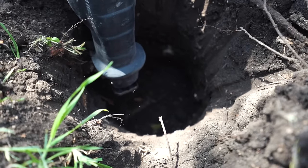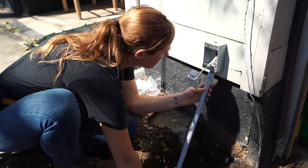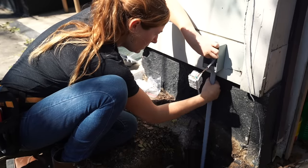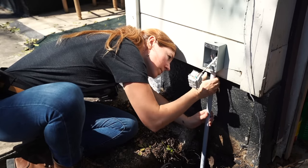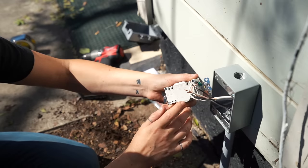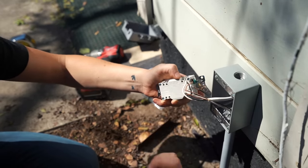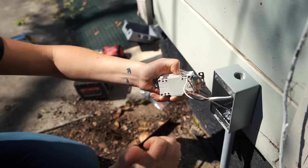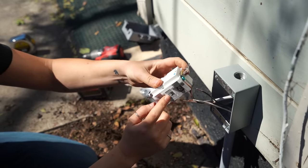Now let's run some wire. Back at the starting point I first ran a piece of conduit down from the box to the trench, then wired in a GFCI. According to code the circuit has to be GFCI protected if it's buried at 12 inches. Be aware that GFCI outlets aren't like normal outlets where the wire's origin doesn't matter. On the back you have a line and a load placement. Line is the power coming in directly from the breaker. The UF wire going out to the lamp post goes under load. Make sure you pay attention to that or your GFCI won't work.